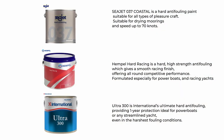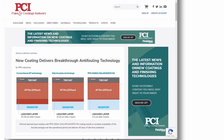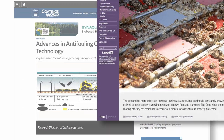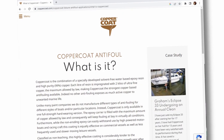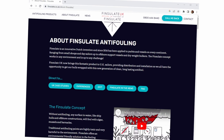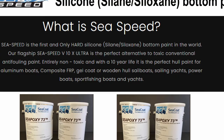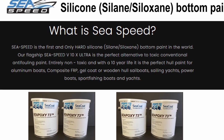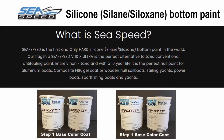For a sense of completion, it's worth mentioning there are an increasing number of alternatives being developed. This is a good thing, as painted biocidal coatings are not good for the environment. There are long-life coatings like Copper Coat, which has been around for a good while and can last up to 10 years. There's a product designed to mimic the surface of seashells, which don't suffer from algal growth. And there's a silicone-based coating which is deemed too slippery for microorganisms to adhere to. But whatever you choose, you pays your money and you takes your choice.